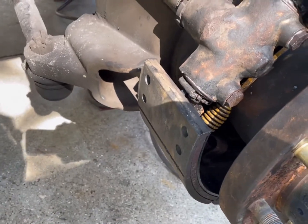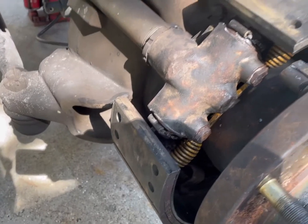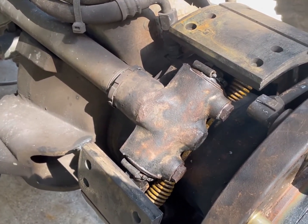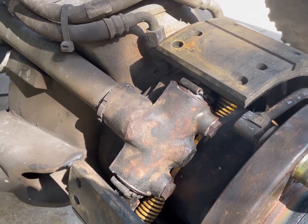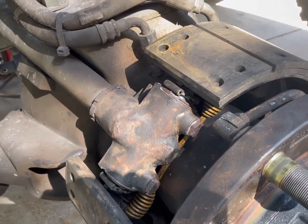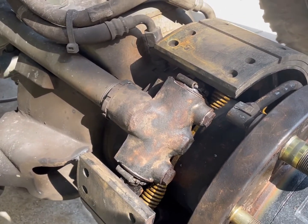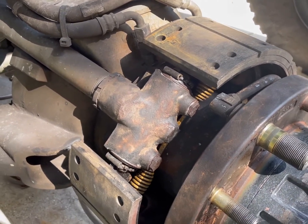You want to do it evenly. What you do here, do up here. That's to get you started. Draw it close to the drum, so that in case you do apply the brakes and they're not fully adjusted properly, you at least have brakes. The closer to the drum that you get them, the more accurately they'll be adjusted. And yes, it may make it a little bit difficult to work on, but at least you'd have brakes.